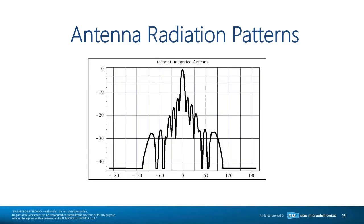An antenna radiation pattern, as published by antenna vendors, shows a main lobe and side lobes. The voltage pattern you get when you move the antenna right-to-left or up-down will look similar to this radiation pattern. If you moved the antenna with 0.1-degree increments and wrote down the voltage, you could recreate this pattern. This also shows why it's a really bad idea on millimeter wavelengths to intentionally misalign a radio.